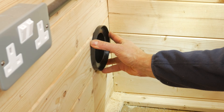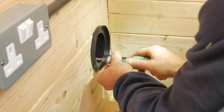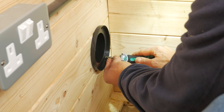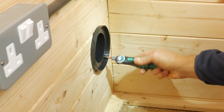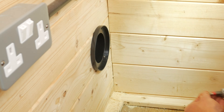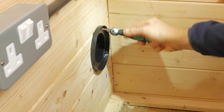After testing various configurations I ended up installing the newer TB Max outside my office. All you really need to do is drill a hole for the hot air hose — H-Calorie include a vent for a neat finish. The only issue with this setup is that you're only blowing hot air in, which slightly pressurises the room. When that happens the warm air you've just heated gets forced out through any gaps in the building, and the heater ends up pulling in cold outside air for its intake, which is less efficient.